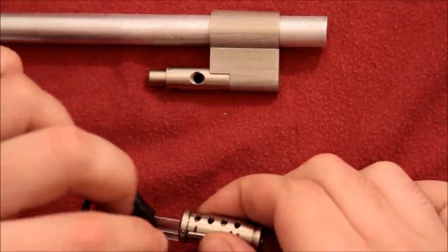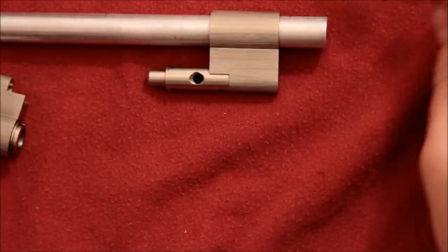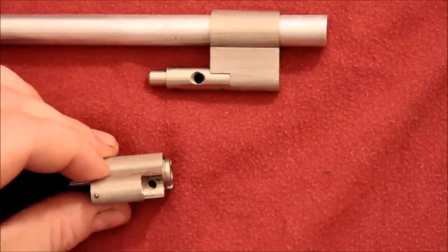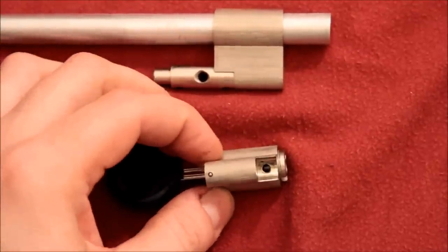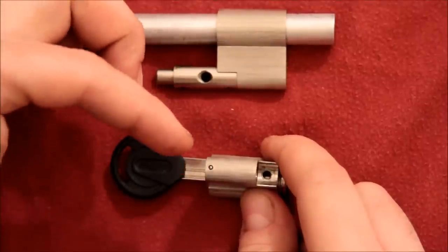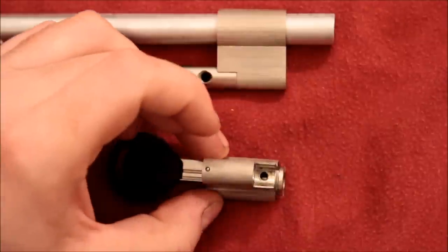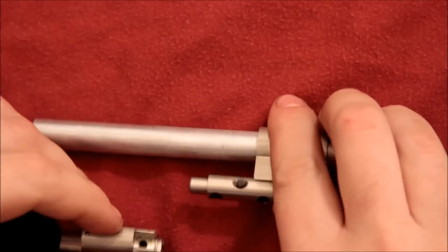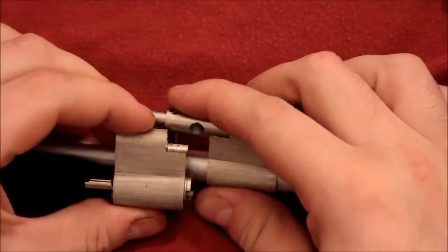In addition to all of this, we have a drill pin here and a drill pin on the other side. The shell itself has drill protection. I found that puzzling when I was working on the lock before I'd taken it apart — normally you'd have steel drivers or various other things in there. The reason is that this lock has an interesting construction. I removed this screw here, and the screw holds each of the two cylinders onto this pin.